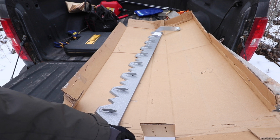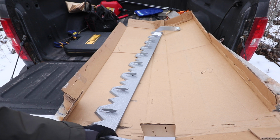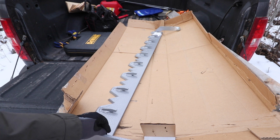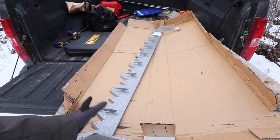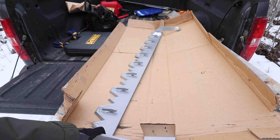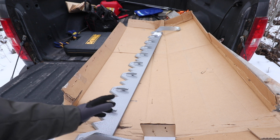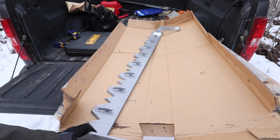And if you're looking for what the dimension is on this, it's 61 3/4 inches for ordering the TYM 2515 bucket size. So that's an important designation to find, is you got to order this to the nearest 1/4 inch of the bucket, and 61 3/4 inches works on that particular bucket. So in order to order this, you need to measure your bucket to make sure you get the right size. But if you got a TYM 2515H and it's got a 62 inch bucket, then you can get the 61 3/4 inch cutting edge, and it's going to fit right on there.